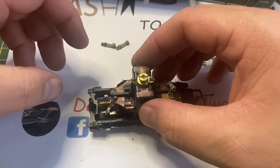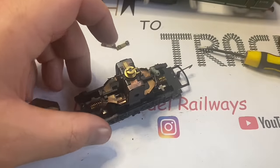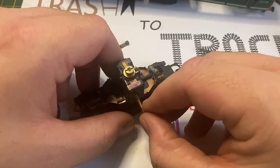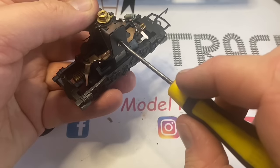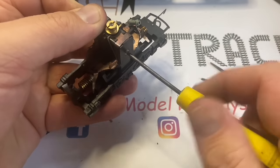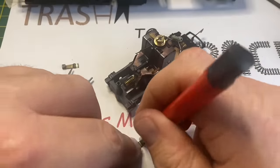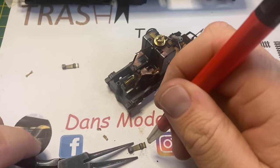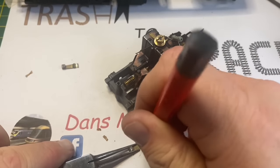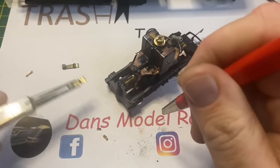And then this whole pickup assembly on the top is slid over the magnet. The bolt is re-threaded through the holes in the magnet and the magnet keepers, and then holding that nut in place again with my finger on my left hand, I just screw that bolt tighter. And then it's all back in place. The ends of the brushes were polished up with a fiberglass pencil to clean the brass to make sure that everything was spotlessly clean for good electrical conductivity.